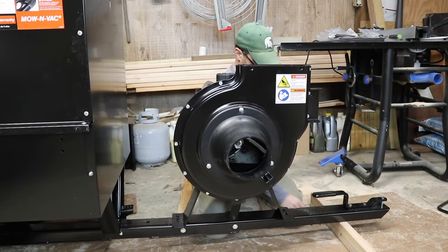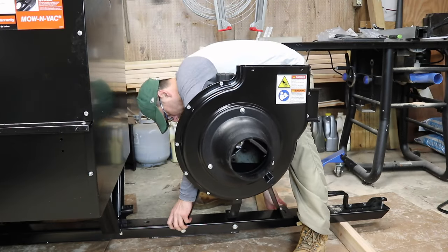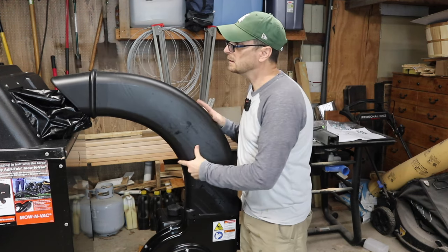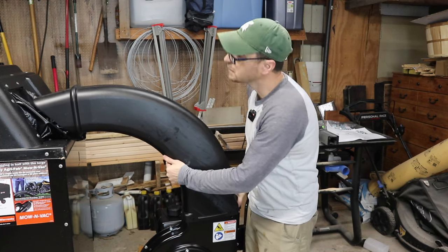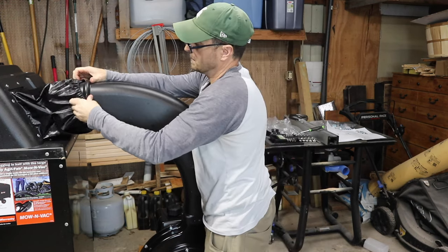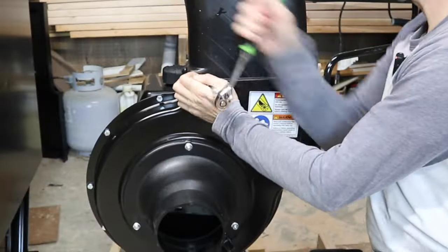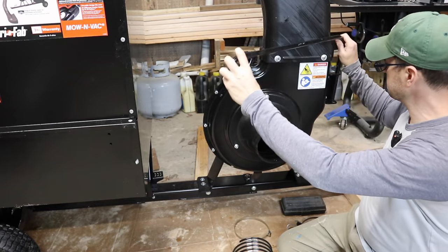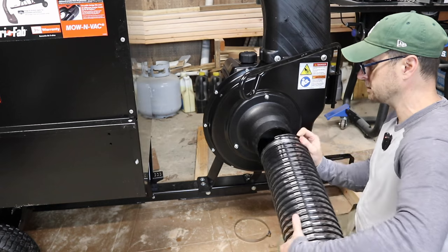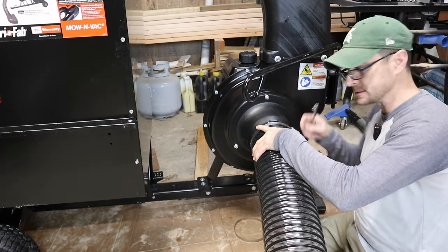It's a tad unstable up here, so make sure you hang onto it. Just get one bolt started and that will hold it. Once we have the engine and impeller mounted, we're going to put on our impeller chute, and it needs to align with the opening on the cart. If it's not aligned, you're going to have to move your engine assembly left or right a little bit — it's got some play in it. Attach everything with the self-tapping bolts and nylon washers — these are a half inch. Then put the hose support in and attach our hose to the impeller with a hose clamp. The hose adapter can take the six-inch hose that comes with the kit or an eight-inch hose if you want to upgrade.